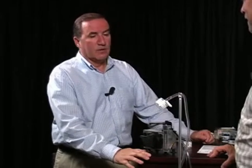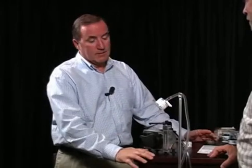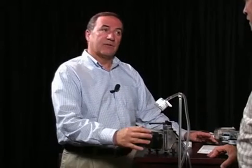Now, some people will say that a garage sample is an outdoor reference sample. A garage sample is not an outdoor reference sample. A garage sample is a garage sample, and so it is a room in the house. Even though it's an attached garage, it is a garage sample. And garages, in my experience, have shown to have lots and lots of fungi and lots of different kinds of fungi. So don't expect a garage sample to be an outdoor sample.